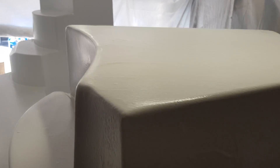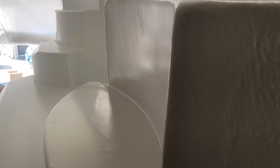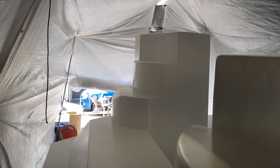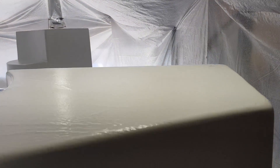That sort of went as to be expected — not great, but it never does, it's always something. I had a couple of little issues, but it's such a big module. To spray every surface of it to perfection — I've got a little bit of a double-up here, but it's gone off so I'll be able to just sand that lightly before I start laminating. You can see down in here on these little recesses, which are actually where the teak or fake teak flooring butts up against on the stairs — they are very difficult areas. I might get my spray gun out and give those sections a really light bang, because they're the areas I'm really going to have to pay attention to tomorrow, especially in those 90-degree corners.